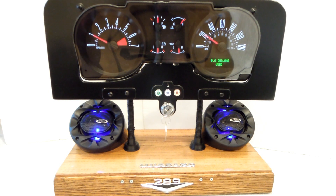The second row with buttons four through six are used for some standard gauge settings. Number four does 3500 RPM at 60 miles per hour. The five and six buttons are for some preset conditions that are easily changed in the Arduino software using a table — number five is gauge preset one and number six is gauge preset two.